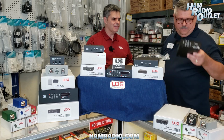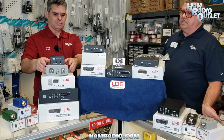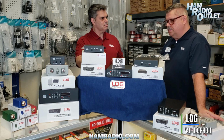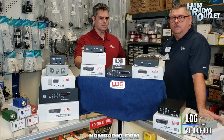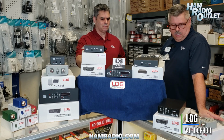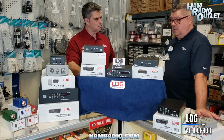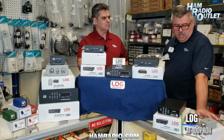Okay. Excellent. And we'll move up to the AT series. With the AT, let's see here. I don't have it here today, the 100. The one I have here is the 200. Now the 100, the wattage is 125 watts, 30 watts digital, as well as Julian mentioned, 4,000 memories in this tuner. And again, it tunes within 6 seconds and basically instantly in regard to the memory frequencies. It does have a built-in frequency sensor as well. This series does, the AT, and again, 160 to 6 meters.